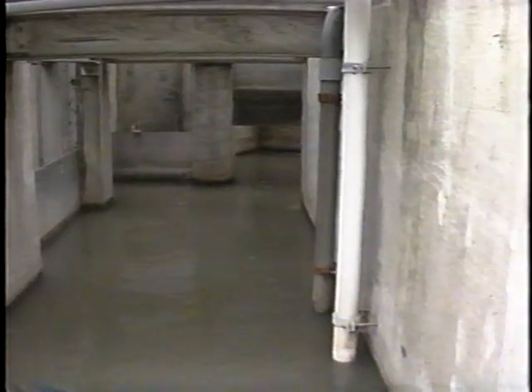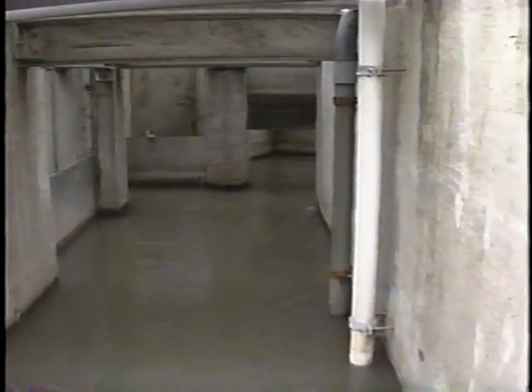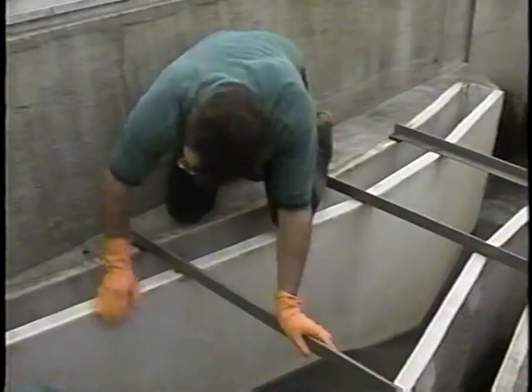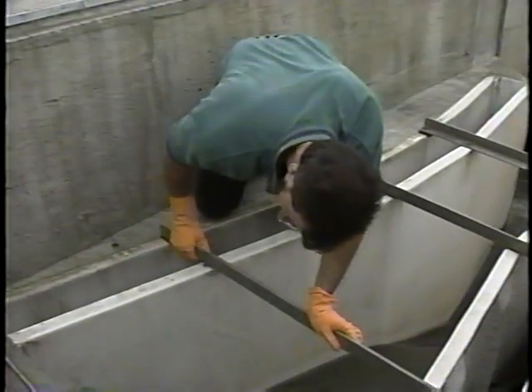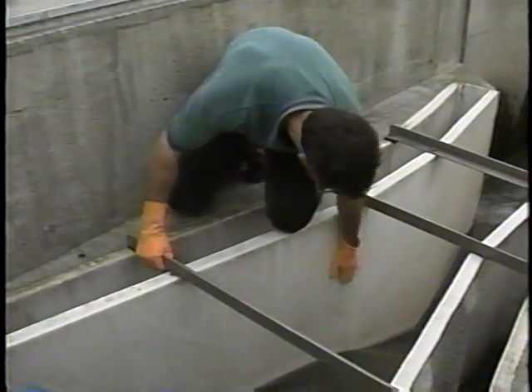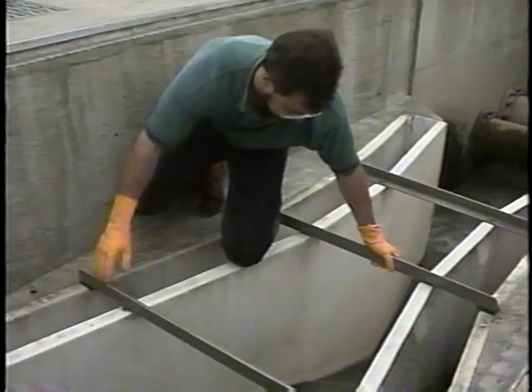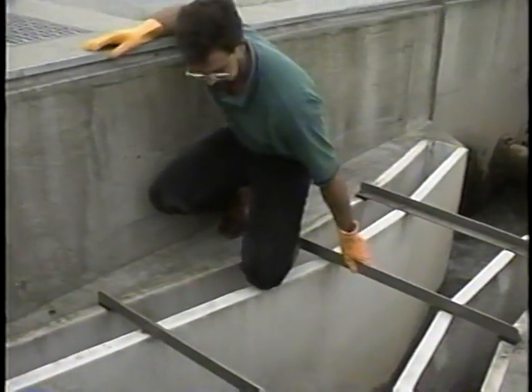Check to see that the flume has been placed in an area free of turbulence. Next, check the integrity of the construction materials — are they still in good condition? The flume we're inspecting is fiberglass, but some Parshall flumes are metal, some plastic, and some are made of concrete. It doesn't really matter what's used to build it, as long as the materials are corrosion resistant and smooth finished, to maintain a solid watertight foundation that maintains measurement accuracy.